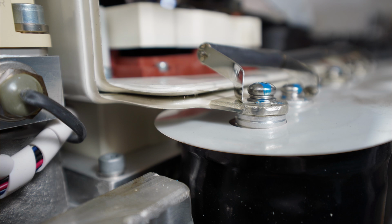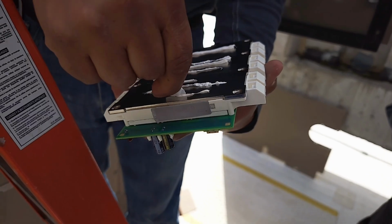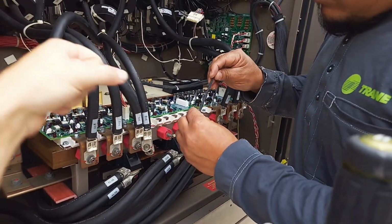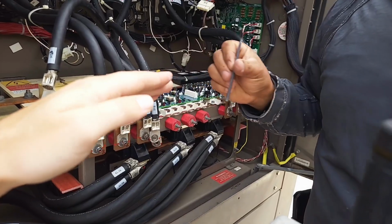But in short, think of it as an inverter. It is taking DC voltage and then manipulating that voltage to simulate a sine wave going to our compressor. Because we can simulate sine waves through triggering negative and positive DC pulses, it's also known as PWM, pulse width modulation, we are able to make the motor think that it's getting an AC current. Now these compressors are designed and referred to as inverter duty. So these motors are capable of being run on a drive. Not all motors are, so be careful of that, but if you've got a manufacturer design a compressor for this, you're going to be okay.